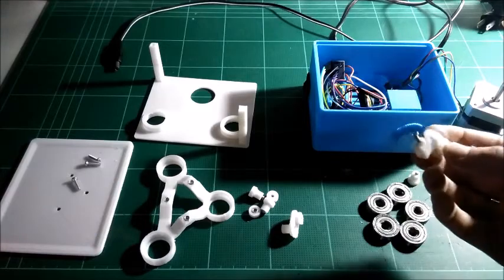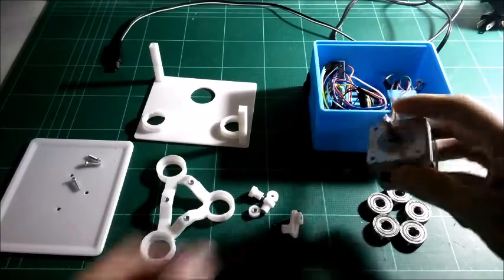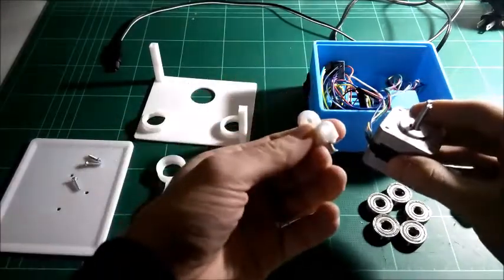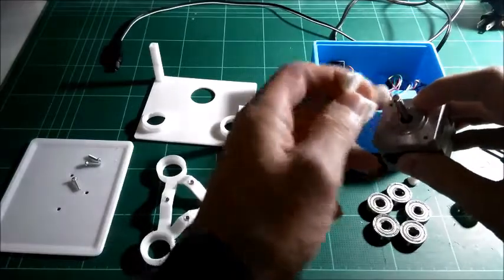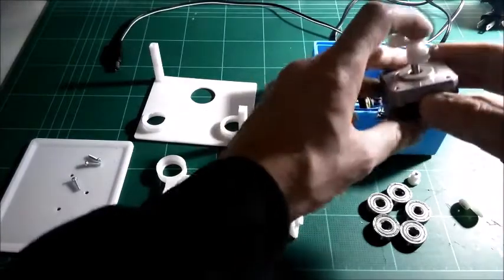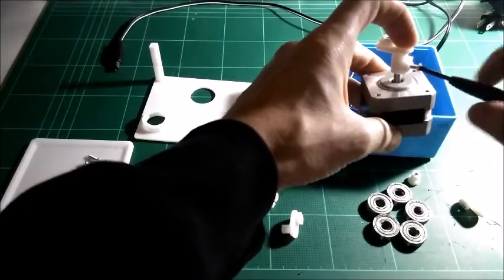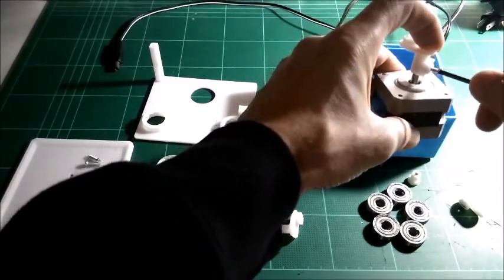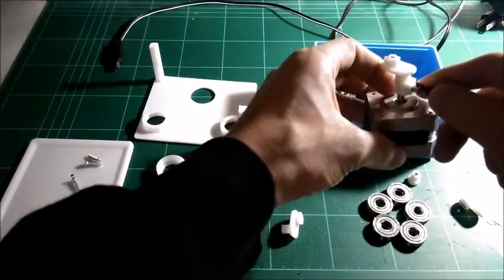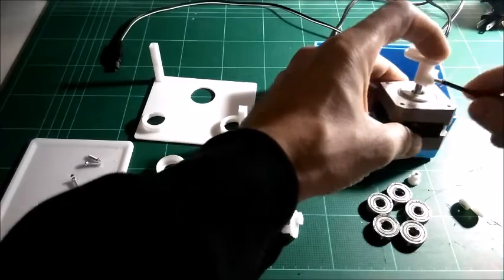The first thing we're going to do is put this coupler onto the shaft of the stepper motor. On this one I've cut a notch, but you don't need to — this was from another project. This is meant to work on your stepper motor shaft whether it's completely cylindrical or if it's got a slot cut into it already. Push it all the way down. There is a nut friction welded in here — just tighten up this bolt. Be careful: the bolt, nut, and shaft are all metal, but this coupling is plastic, so if you over-tighten it the plastic will give.